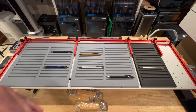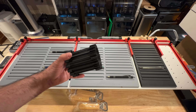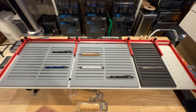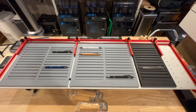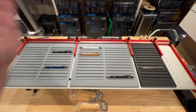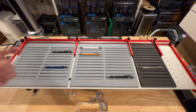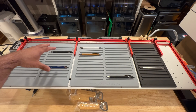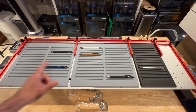For those of you who do a lot of pens — traditionally you'd use a rotary with maybe a dozen pens, loading and aligning each one. Check out this tray: 60 pens, all engraveable in one shot. I can load this tray a lot faster than loading a rotary one pen at a time. I have a little guide that aligns all my pens on the tray, and the tray moves back and forth as it gets engraved. You'll want a 300 millimeter lens to cover this area nicely as the Maxi Index table moves your content.